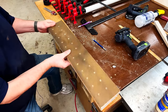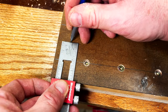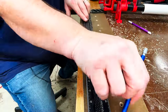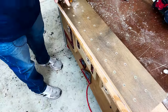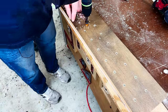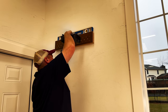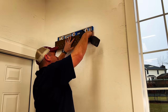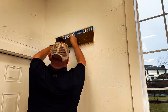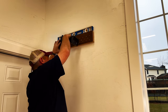To mount this to my wall, I'm striking a line at two inches exactly, then taking my T-ruler and carrying that line across the entire piece of poplar. Once that line is drawn, I pre-drill and countersink a hole at every two inches down the entire piece. Then I take it to my wall, sink a screw right in the center of this mount, and use my level to make sure it's completely level before adding any more screws. With all these screws in place, this thing isn't going anywhere.